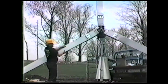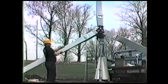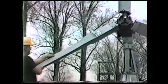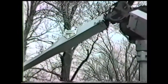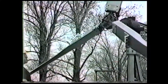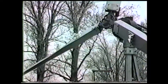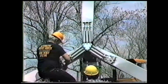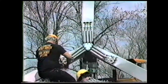We've just installed the completed blade assembly on the main frame. I'm demonstrating how the governor allows the blades to change pitch. This feathers the blades, which reduces their bite in the wind, slowing the blades and protecting the entire turbine assembly in high wind conditions. This unit has actually survived wind speeds in excess of 100 miles an hour. During operation, feathering is controlled by springs which connect the blades to the governor. I'm adjusting spring tension to a predetermined setting to allow the blades to feather in winds over 28 miles an hour.